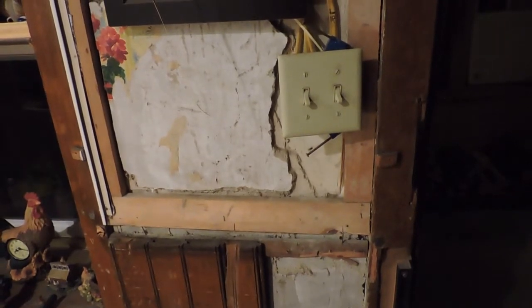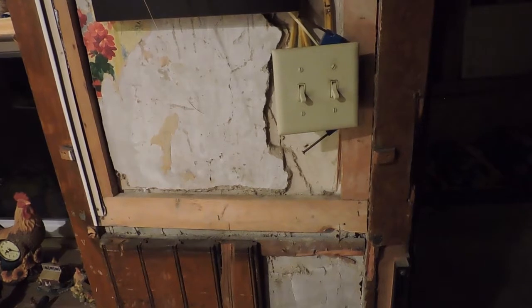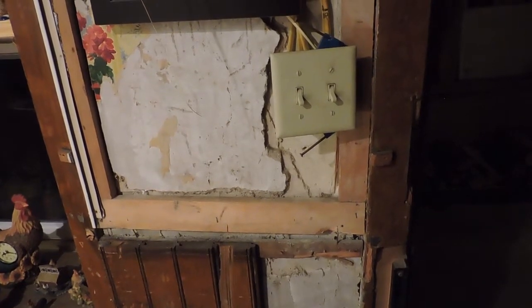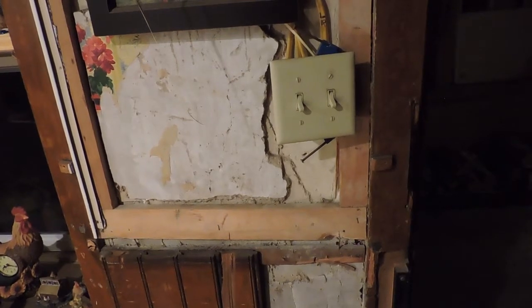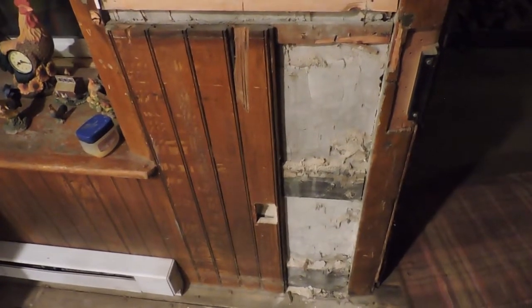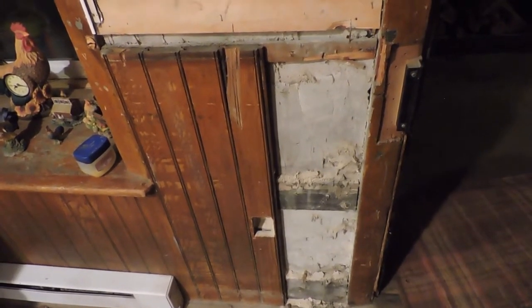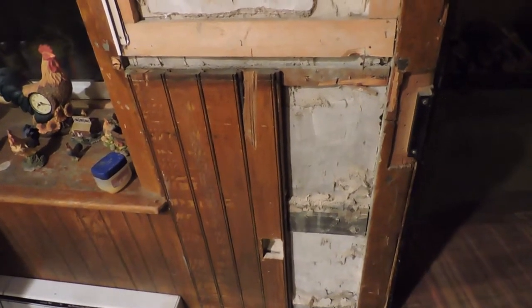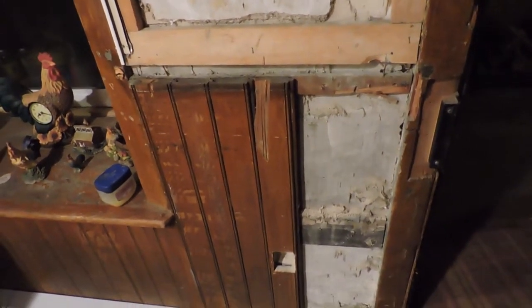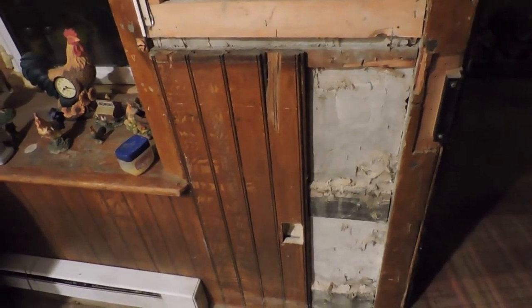This was a temporary setup that I will do a bit better when I finish off things. But the electrical feed for the lights and receptacles for the living room comes into here. So from here I need to go down into there and then be able to move around the room. So I'm forced to take this wainscoting off. I don't mind doing it because there might be some other spots where there's mold behind it and so on. I want to put a little bit of insulation and make the room a little warmer.